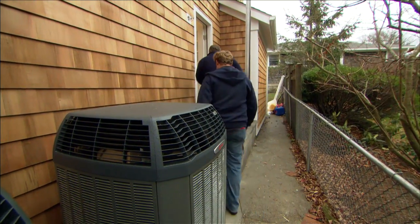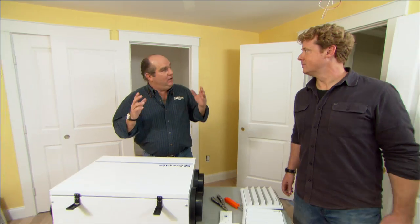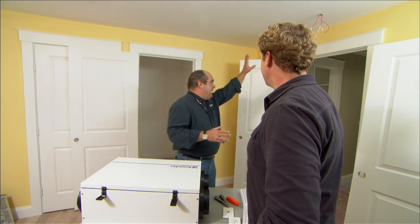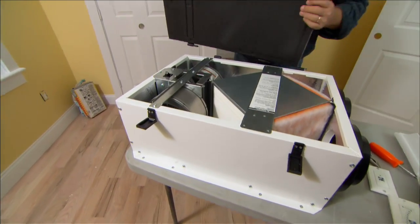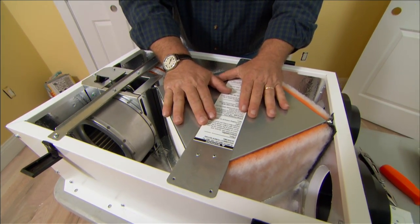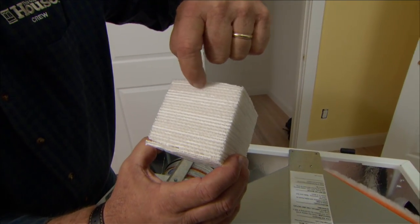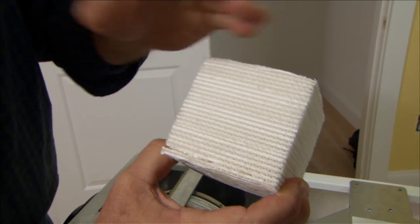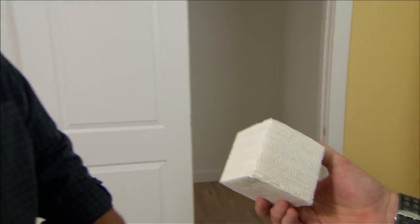Another efficiency feature is the house's spray foam insulation and great windows — but a lot of people don't think about how to get fresh air into a building that tight. Up in the attic crawl space there's an energy recovery ventilator. It has two fans and pushes air across a core. The core has corrugated layers where the corrugations go in opposing directions each layer, allowing air to pass through adjacent layers without touching. The air is in close proximity but never mixes — heat and humidity can be transferred from one layer to the next.